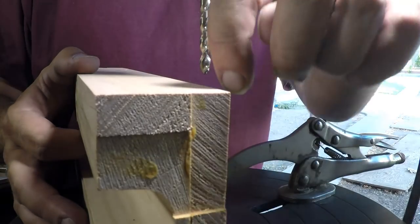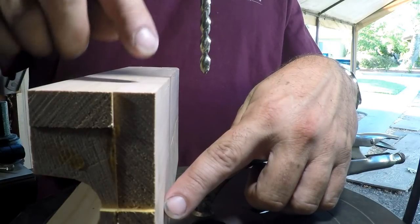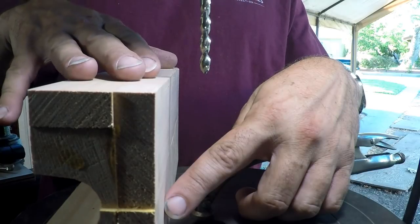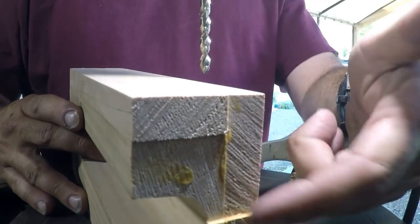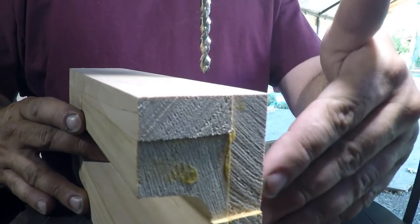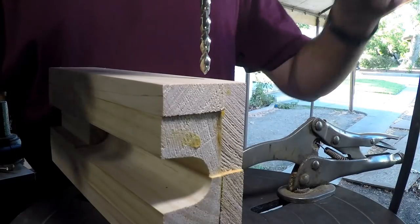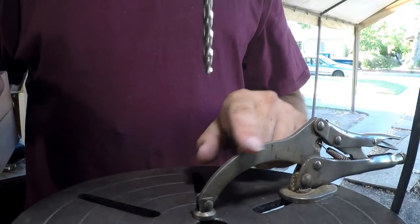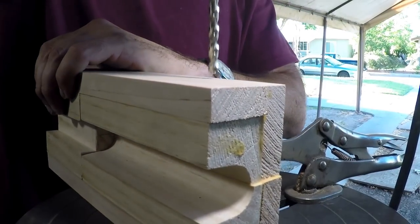The whole purpose of this drilling: we're going to drill all the way through where it goes down into the other board a little bit, then we can put dowels in there — glue them into one side — and that'll make the box able to slip together and register very well. We'll also have to trim this anyway, so hopefully when I cut it, it should break the glue joint and we'll be free again. I put this clamp here just in case the bit grabs and tries to spin — it'll act as anti-rotation.